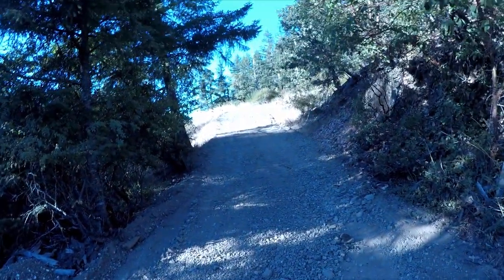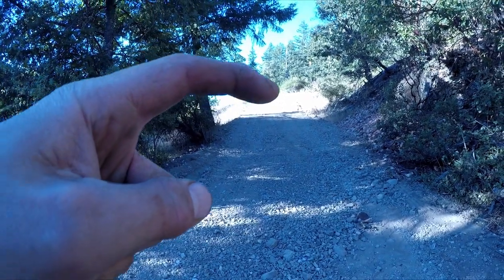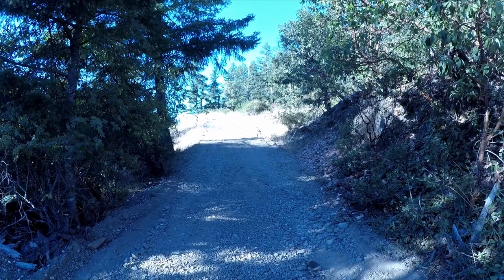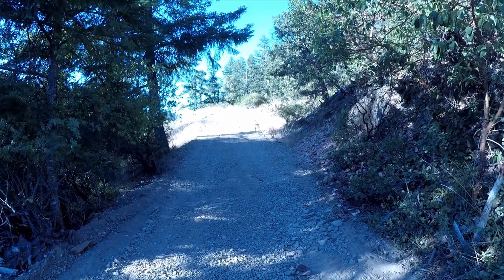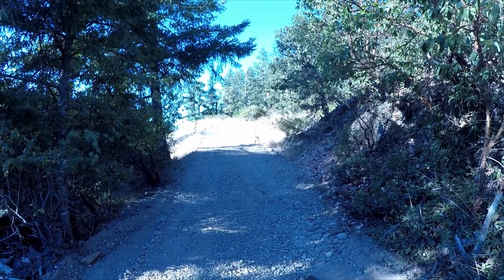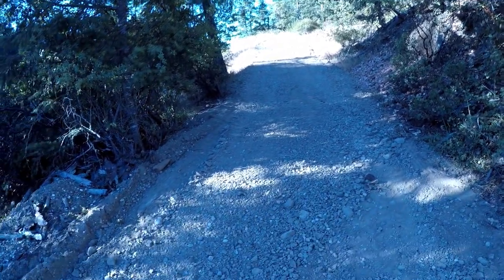Hey YouTube, we're all done with this driveway job for now. Once I fix the four-wheel drive on my truck, I will haul some more rock down here. You can look at it, I don't quite have a crown. A slight crown in some spots, but ideally it needs to have a crown. But I'm just going to haul more rock and put that on top and put a crown on top after this gets compaction.